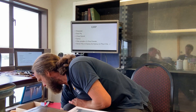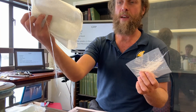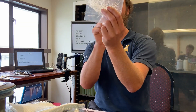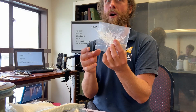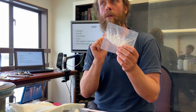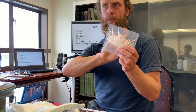Little known fact: chop strand mat — as opposed to woven mat — what keeps chop strand mat together? It's got polyester vinyl type resin glue on it — a polyester glue holding these fibres together. You cannot use chop strand mat with epoxy to its full bond strength, because the polyester glues in there will never break down.